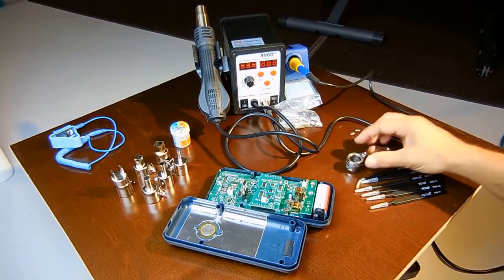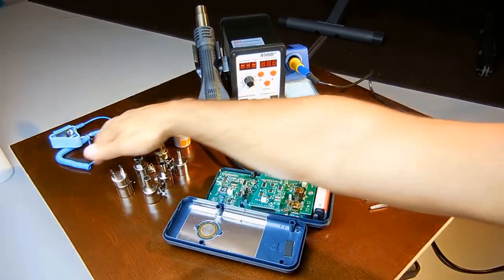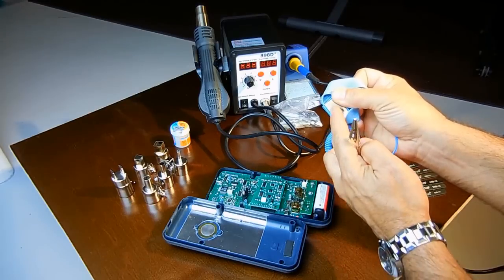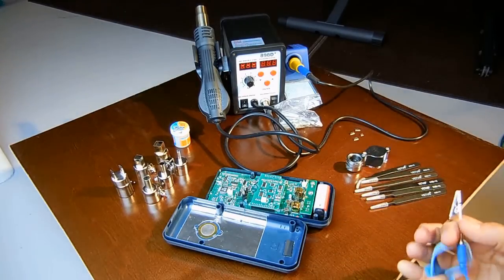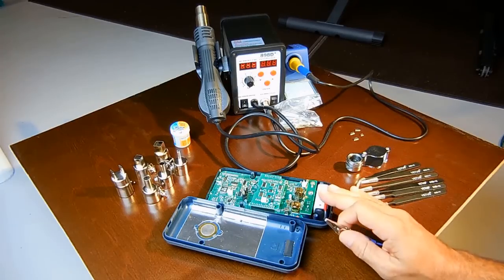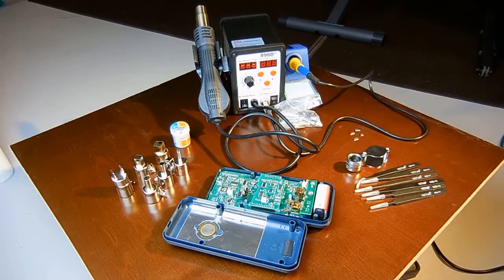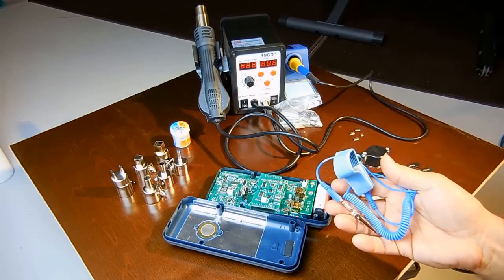It's a good idea to have an eye loupe — you can also purchase one you can wear on your head. To be extra safe, you could purchase a wristband like you see here. There's a resistor between 1 and 10 megaohms between the connection and the clamp. You can put this on your wrist, connected to the negative of the circuit with the battery disconnected, chassis ground if you're working on a large television, or connect it to a grounded metal object close by. Straps like this are very inexpensive and available just about anywhere online.